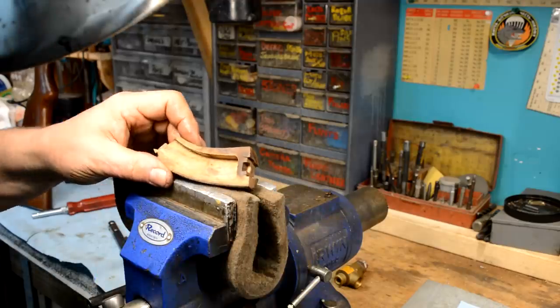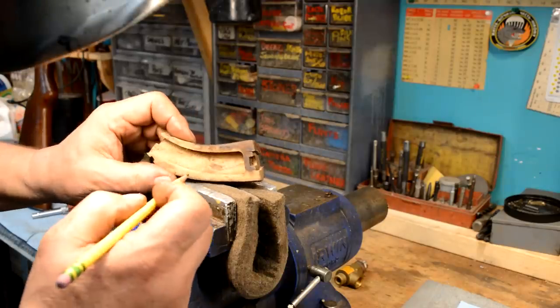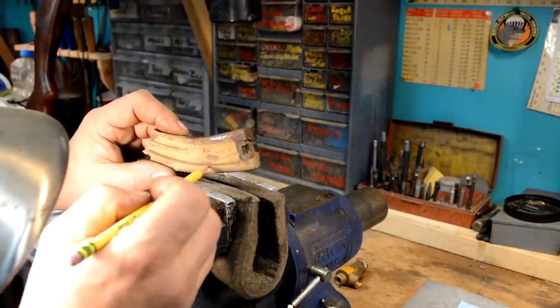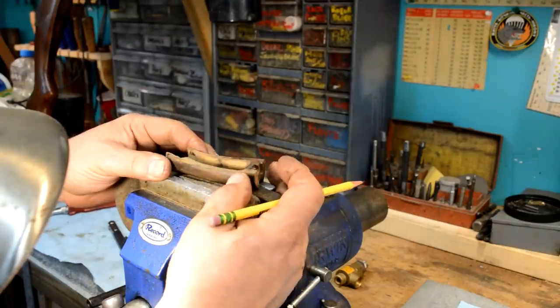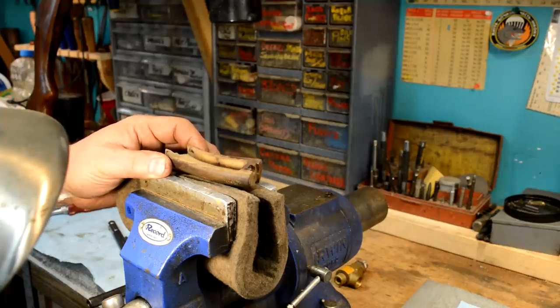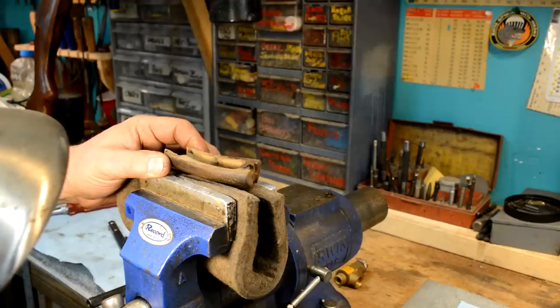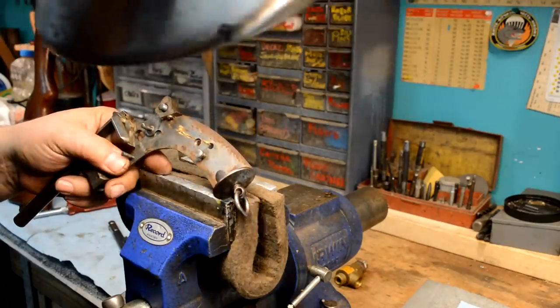So a lot of people will ask, how come they're not making Garands anymore? What would it take to make a Sturmgewehr 44? Well, the problem is when you're all tooled up, let's look at this grip right here. We're going to make one of these by hand, but we have an inlet that has to be done all the way down in here to make room for the spring. There was a jig. They sat this thing on a jig near it, and they cut it. And it was basically a stock duplicator, and they were making 50 of these things a minute. And we got to make one of them, and it's going to take a full shop day. And that is why your pet milsurp isn't being made anymore, because all of the tooling necessary to make it doesn't exist. And to make one of them by hand is prohibitive. Just ask Mr. Garand.